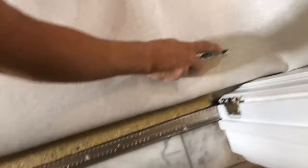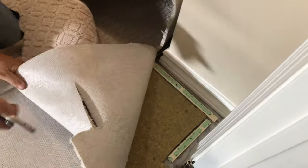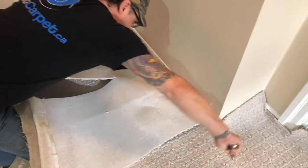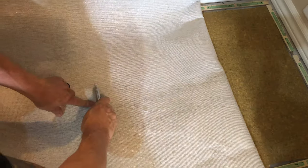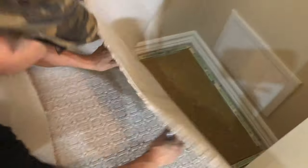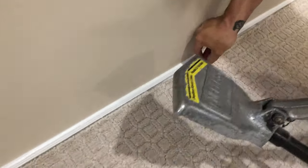I like one-piece seams. We're cutting in front of the metal with a couple of release cuts. Whenever you do that, watch the razor blade — if you've been using it for a while, you don't want to cut through fast and slice the carpet underneath. I've been doing this for a few years now. Watch the knife trick — one, two. A quick way to measure if you don't have your tape measure around. There's tons of extra but I did that on purpose so you can see. I want to line that up — actually, that's the seam and I'm free-handing it.